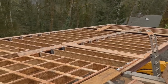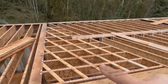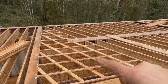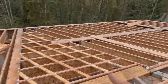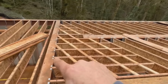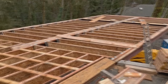Okay, this might make a little more sense now. I've blocked that on the same joist centers as those. That's just a walk board, so it'll catch all this stuff coming across. We'll still nail to these joists because that's where the bearing is, but we'll also nail everything to these, so all the edges will be blocked as it goes, and it'll allow all of that to tie in a shear axis over to here, which is another, I think it's a W14 by 61. Okay, that's that.